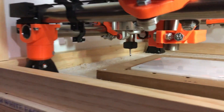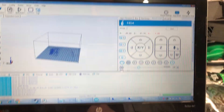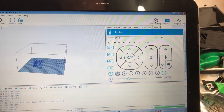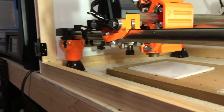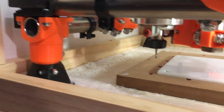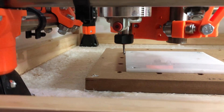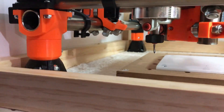Let's back that off and move Z up a bit. Now we can type a code to check our zero — G1 commands a movement. If I do G1 X0 Y0 Z0, let's see where it goes. It's moving a little slow, that's all right. That's where it thinks zero zero is — that looks pretty aligned, and the Y looks pretty close too.